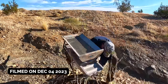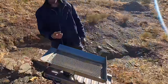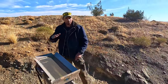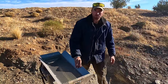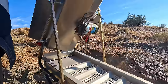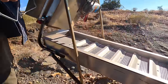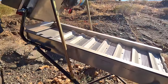There's the beast — never used a dry-washer before. This one's a little different than your typical dry-washer. Most dry-washers have a little windmill on the bottom of the deck, with a blower pushing air through it to spin at a certain RPM. A counterweight makes it shake, so you get air coming up through the bottom of the riffles and vibration from the motor. This one doesn't have a windmill — it has a vibrating motor which is loud, but it allows the classifier to work faster and gets material across the riffles a lot quicker. It runs a bit steeper than most and works great in this loose fine desert soil, doing a really good job of capturing the coarse gold.